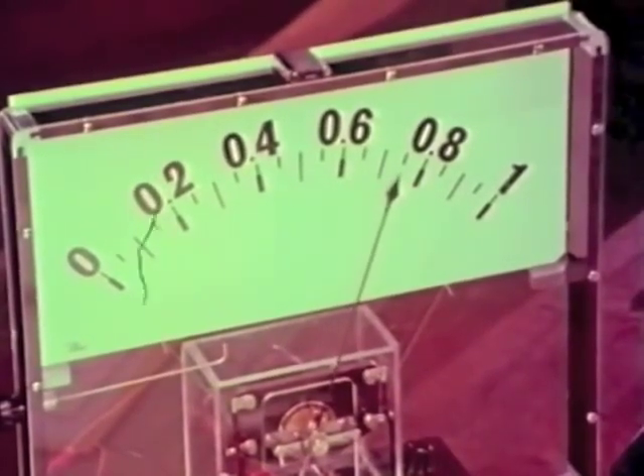As I slide the copper round towards the pole I'm covering more and more wires, so the current continues to increase. The law of nature is such that it will always try to reduce the reluctance of the external circuit. This is the rule we shall now use in place of the rule of magnetic poles, and we can use it to explain all the phenomena of magnets which we saw earlier.